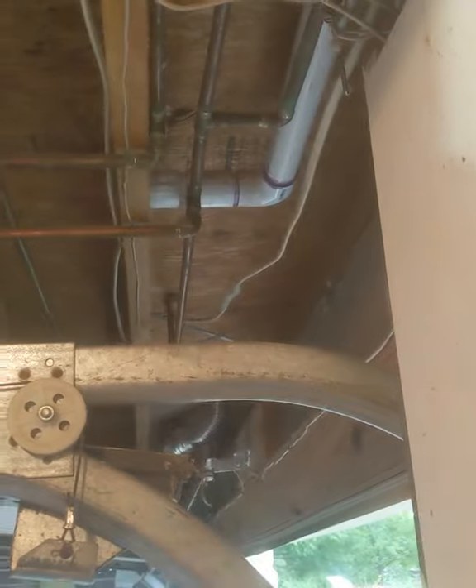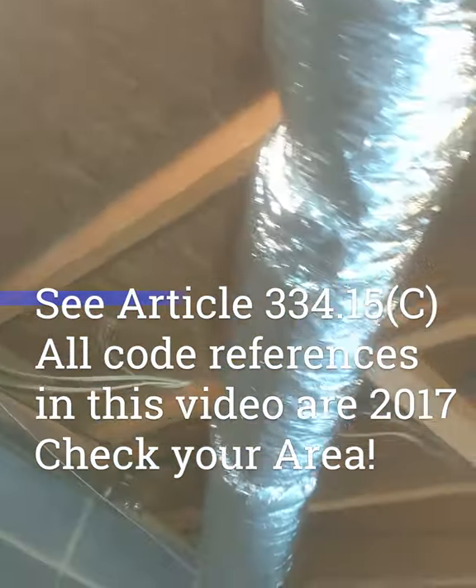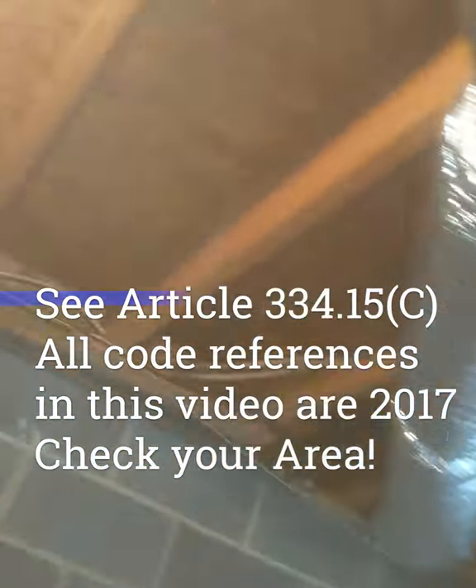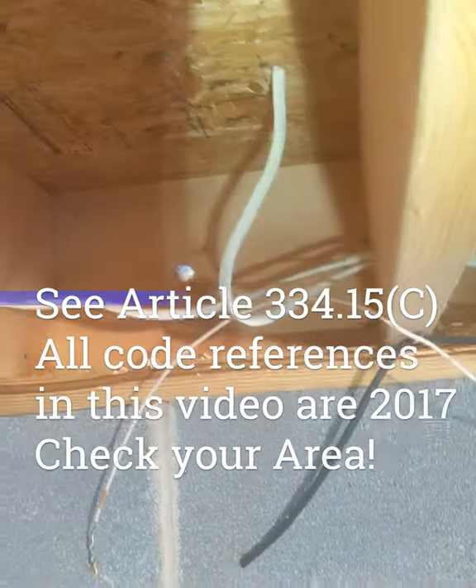I've routed my path. I can go right up through there with staples, and I've drilled holes — you can see the shavings. I've drilled holes all the way through. You are allowed to run cables 8/3 and larger to the bottom of the stud, but with this height and everything going on, I went ahead and drilled bored holes. Then to get outside, I popped through right there.